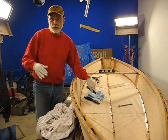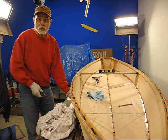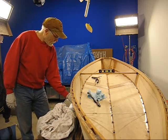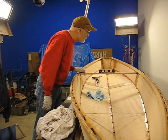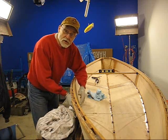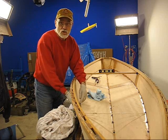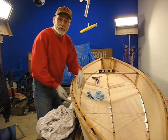The other thing you want to do besides making sure the sides are tight: go around and flick the wires, give them a little pull and tighten if needed. Then go around with your wrench and make sure all the nuts are tight. Give it a good visual that nothing looks out of line, and on the outside use your fingers to feel that edge — that it's not riding one way or the other. Go 90 degrees to the seam rather than sliding, so you don't pick up a splinter.